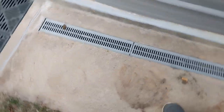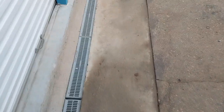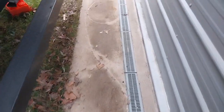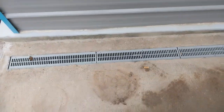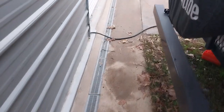This was about 66 bags of 80-pound quick-crete to pour this, and it took us several hours — about four or five people taking the bags, cutting them open, and dumping them in the machine. When you're dealing with 80-pound bags, I only suggest that you use two at a time in the machine; anything more and it's going to overflow out the front while it's mixing. This right here was a pretty tough one — it was in the middle of summer, at night, very humid. I hate to say it, we went through hell throwing all those bags; they are very, very heavy.